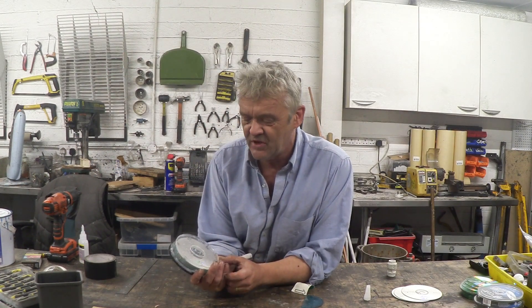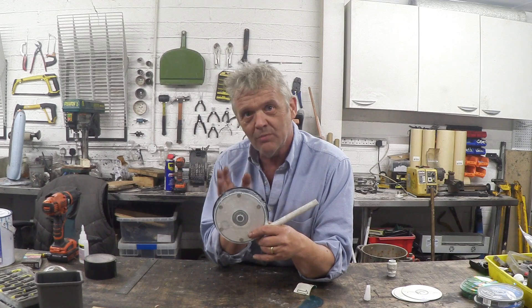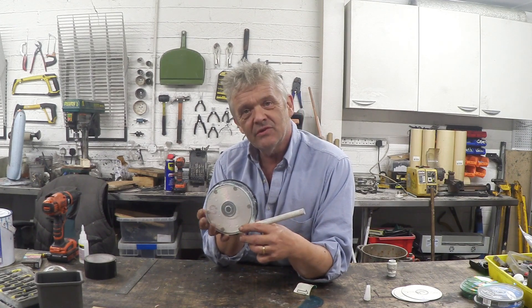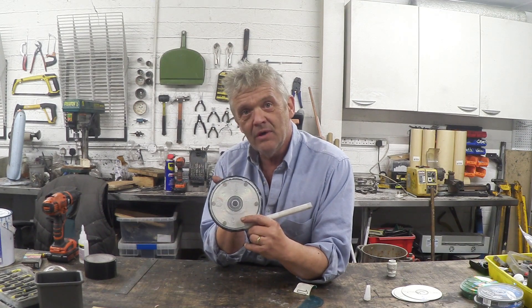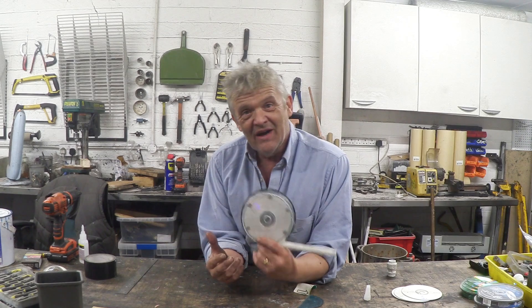That's amazing! It probably took me about 15 to 20 minutes in total to make this thing, so I'm going to call it the '10 Minute Tesla Turbine' because it rolls off the tongue better. It's a complete lash-up using this magnet arrangement, but underwater it can actually generate electricity — and I think that's awesome. These things work better if you make them more carefully, and they work better under compressed air; that was turning quite slowly, just a few RPM, but you can get these to turn at tens of thousands of RPM on compressed air. I thought I'd share that because it's a super simple way of making a Tesla turbine that needs just a CD case, some hot glue, and some magnets. I hope you enjoyed the video — thank you very much for watching, and please remember to like and subscribe.